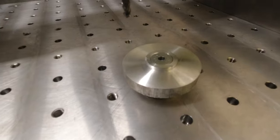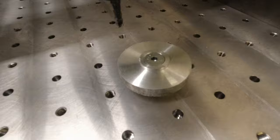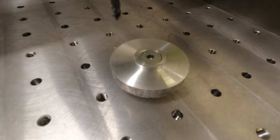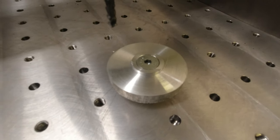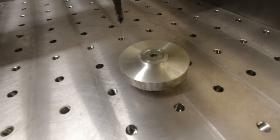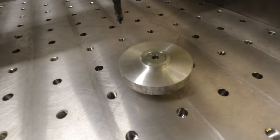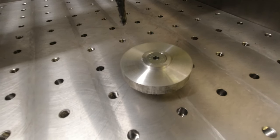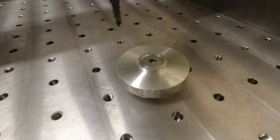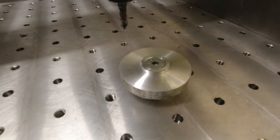Now I'm going to try cutting aluminium for the first time. I'm going to make a sprocket for my go-kart I'm building — you can see it on my channel in a playlist named Lil Borker. The settings I'm using now are the same I used for steel, but instead of 0.25 millimeters cutting depth I'm doubling that to 0.5 millimeters — otherwise all the parameters are the same. Let's try.